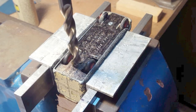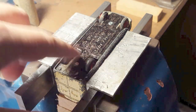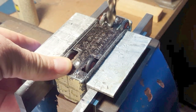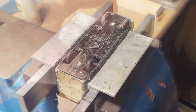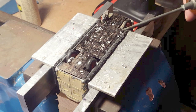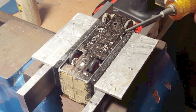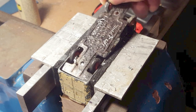First step as usual is to remove the base and I'm using my split point drill. This is a three-eight drill and it works beautifully. It stays on center — I don't need to center drill and I'm still able to get these rivets off. The body being squeezed was holding the base in place, but there I got it off.